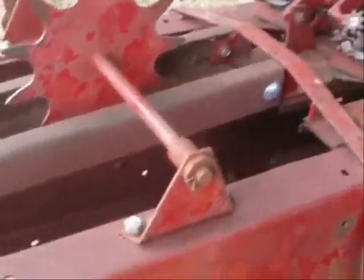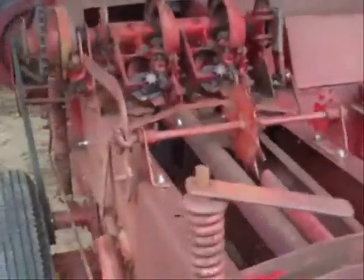I went to adjust this thing and I realized that the knotter was tripped on it. The reason it was loose — see, I still got it halfway just like it was. With the knotter being tripped, this was on this cam here and it was actually pushing it back — the whole rod would come back. So now it's got good tension as it feeds and it trips the knotter. When it trips, this feeder arm goes all the way down, it hits on that and that causes it to tie — this little finger here grabs it, and that's what makes everything turn over. Let me put it back down so it won't be tripping.